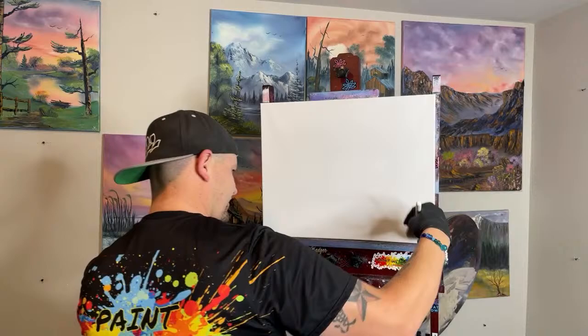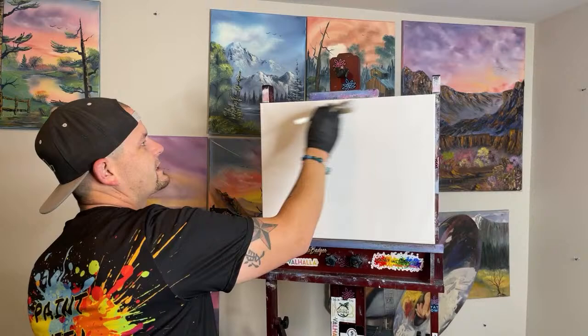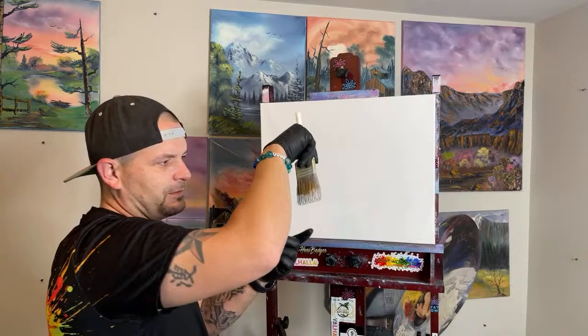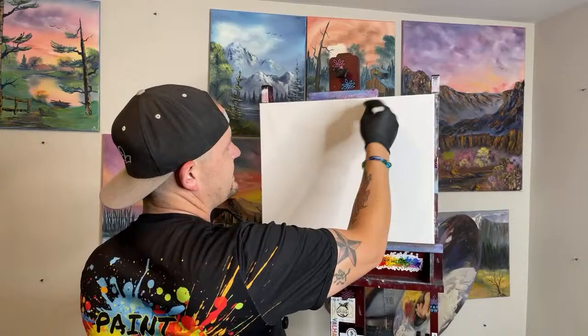Let me finish making sure it's nice and wet — it's got the same kind of sheen across the whole thing, not too thick or thin in places. You've got to kind of turn your head and find where your light's coming from, and see if it's uniformly wet across the whole surface. When I dip, I don't dip in a lot — I drop a little, drop a little, so it's not one giant area I've got to work harder to blend out.